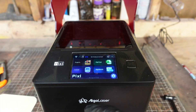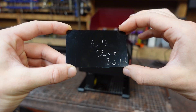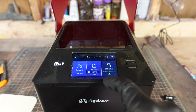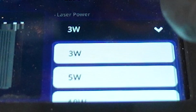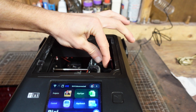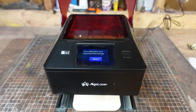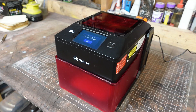The Pixi has four main options after turning it on: text, sketch, controls, and projects. The text option lets you type characters on screen and then laser engrave it, while the sketch option allows you to draw on the screen and then laser engrave that. The controls button allows you to move the laser on the X and Y axis. The projects button is where all the preloaded files for laser engraving and cutting are. My laser cutter is the 10 watt version, meaning I can change the laser power from 3 to 5 to 10 watt in the top right corner. Before using the machine, I had to set the laser to the proper height. To do this, I used the little hammer tool to set the laser's height while adjusting the screw on top of the laser. The machine is a class 1 laser and requires a password to be entered every time it's turned on. It won't start laser cutting unless the shield is placed down, and instantly stops the process if the shield is lifted during a cut — it does automatically resume once the shield is placed down.